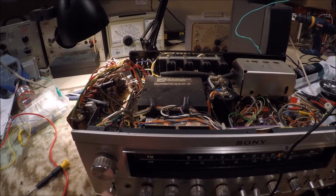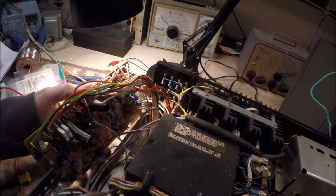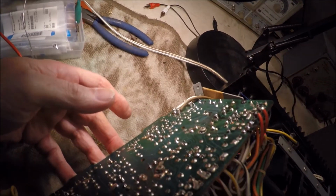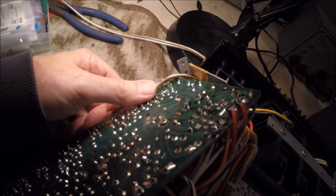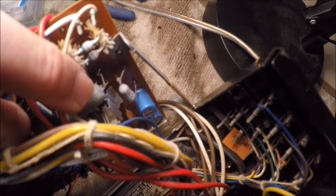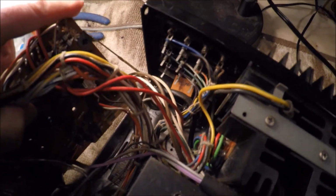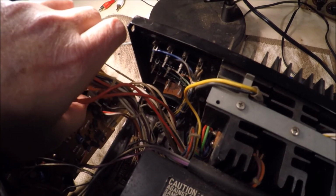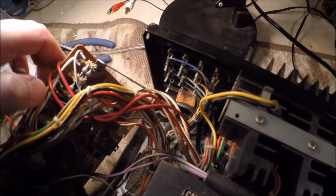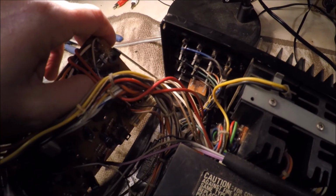Still seems to be a little bit affected down on the bass notes there, so we'll have to figure that out. We don't have distortion, it's complicated, but I did have a chance to come through and touch up, and I did catch that big heat resistor there. You can see that big boy down on the board. That's a big 5 watt. That takes a lot of punishment. That thing gets really hot. So with the heating and cooling, contracting and expanding, it's not unusual that it has some problems sometimes.